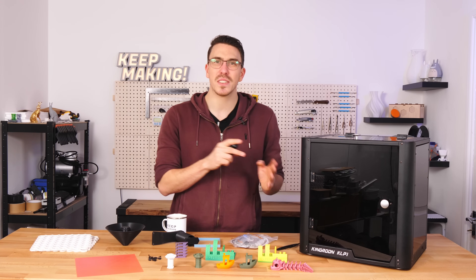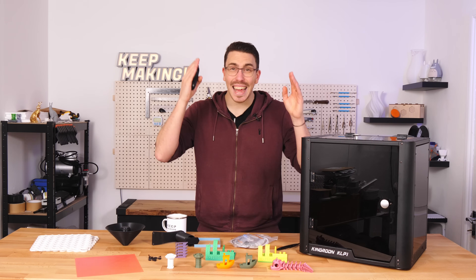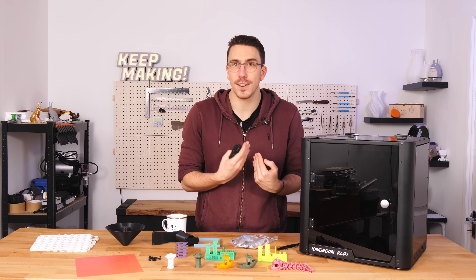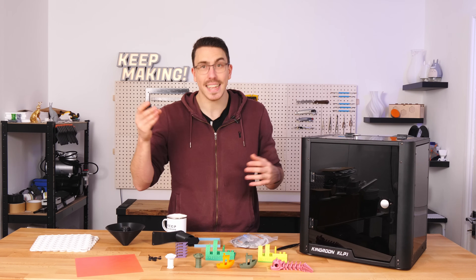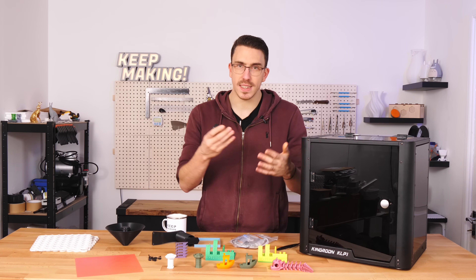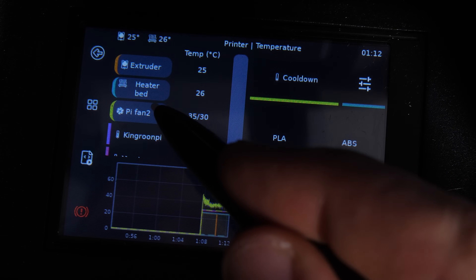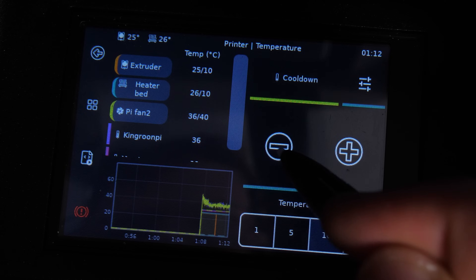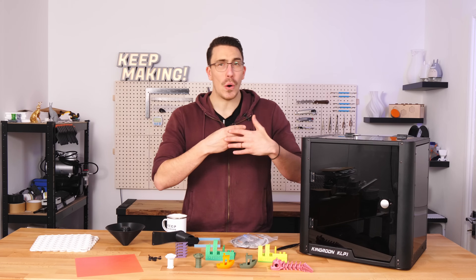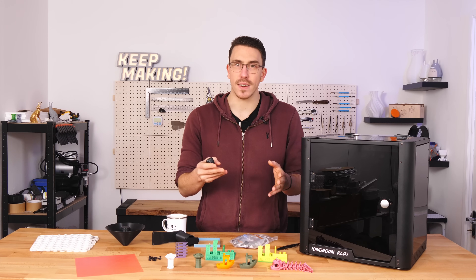The auto filament unload also has issues: it doesn't fully unload the filament, and right after the unload it instantly tries to cool down the nozzle with no way to cancel that cooling procedure, leaving you waiting to cool down just to heat back up for your next filament. I usually just do it manually, but when changing temperatures manually, make sure you're only changing the nozzle temperature and not accidentally changing the part cooling fan or bed temperature — by default all are selected. That's a downside of having full Klipper UI power; you need to know what you're changing.